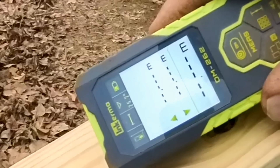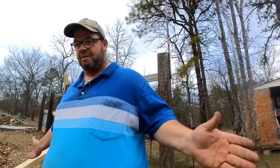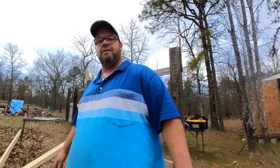It's 25.0 degrees, 25.1. The solar panel angle is going to fluctuate throughout the year depending on the months. If you can get it close to 30, that's a good number. Sometimes it's 40 and even in the middle of the summer it's around 18 degrees. So you just kind of want to get it somewhere in between — I think 25 is a good round number.